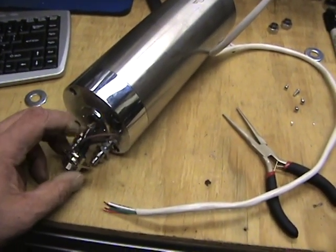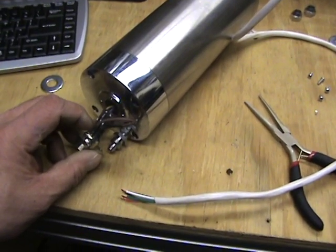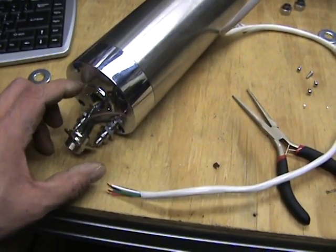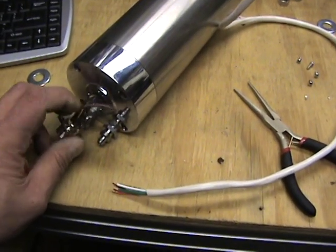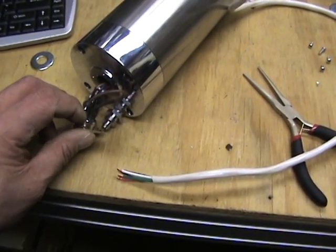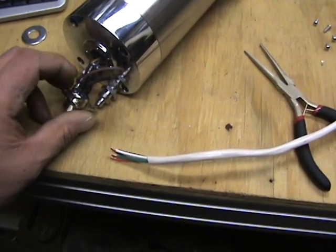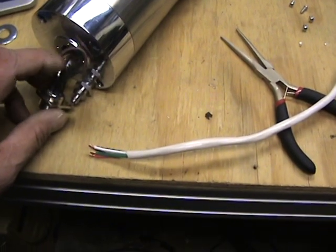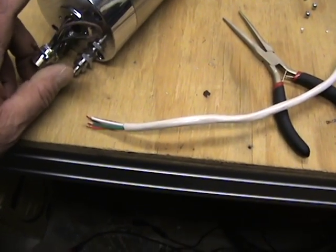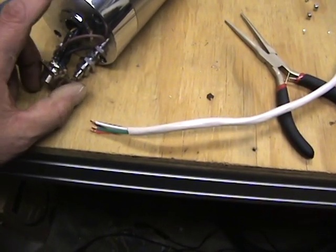So when I opened it up, I pulled the cap off and I realized the number four pole had a position but wasn't connected to anything — there was no ground hookup. I've seen some other people take the back housing off, drill and tap a hole, and connect a wire to that. What I decided to do was something a little different: I connected a wire to that pole and then ground a little bit of the chrome away from the surface on the inside of the housing. It took a little work, but I got it soldered. So now I have pole four grounded to the connector, continuity works out real well. If you connect the ground pole number four anywhere in the spindle, once this is inserted and tightened back up, it will secure the ground.